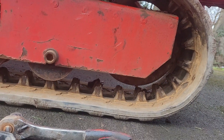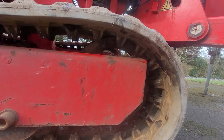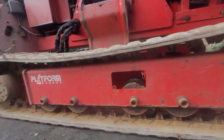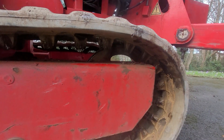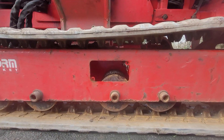There you go. By releasing the pressure on this wheel here, it meant that I could hook the track back over. All I've got to do now is squirt grease into that grease nipple, which is going to tighten everything up and put this track back on tighter.